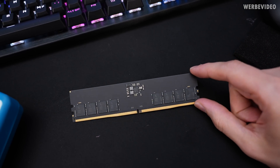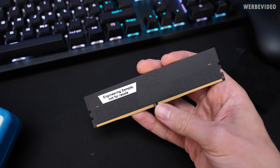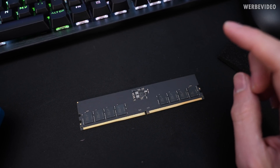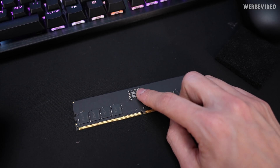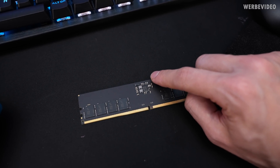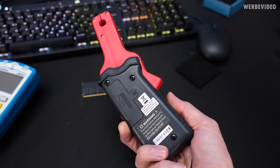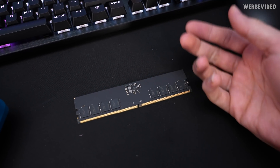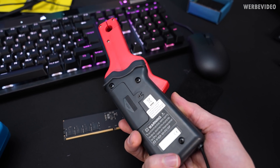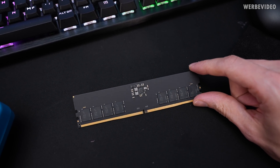The reason I checked for the individual voltages is because I want to know which of these pins is running 5V, since right now I don't have any pinout. So I'll reverse-engineer it — check which points connect to the 5V pins. Then I can tape the 5V pins and hook up a cable to the 5V input points up here. That should allow me to hook up a current clamp to the cable going to the DIMM, connect it to 5V from a PSU, and measure how much current in amps is running to the stick directly.